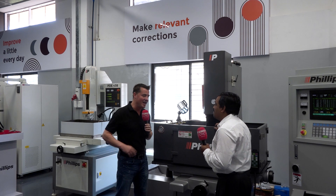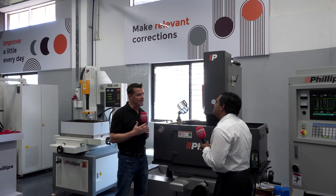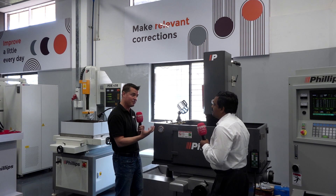You mentioned tools, and now I have another concept — everyone's trying to figure out how to make money. When you work in EDM, you're making parts but there's no longer a really expensive workholding setup or a whole bunch of cutting tools. But this is die sinking, and the wire is not part of this machine — that's the other machine we'll explain later. In die sinking, we make a replica of the profile in copper or graphite material — that is what we call the electrode. Either copper or graphite can be used. For bigger profiles, you choose graphite because the density is very low, which avoids exceeding the machine's weight-carrying capacity. Smaller profiles use copper because of cost effectiveness.